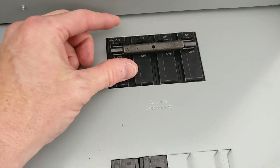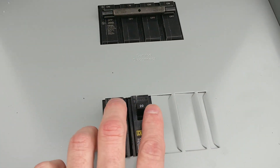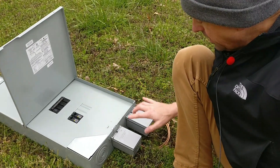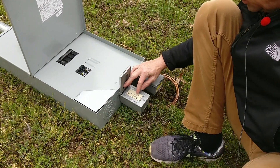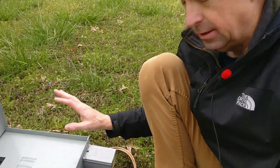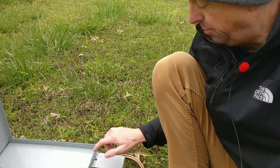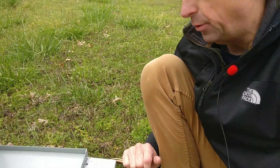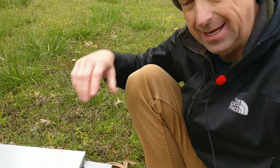For right now, we're coming out of that with two 20-amp outlets — these two circuits here going to these two outlets right here. These are called duplex outlets and these are GFI. So in the event we have some water, something happens, or someone cuts a cord — boom, pops them right here and the circuit pops right there. You don't have any problems. You've got to stay super safe. That is it in a nutshell.